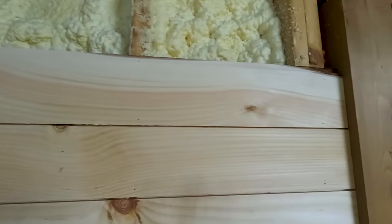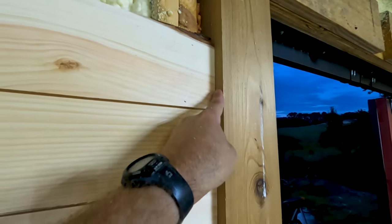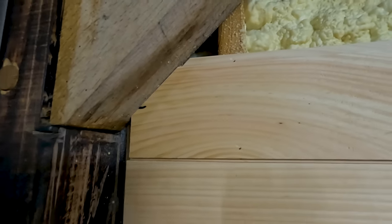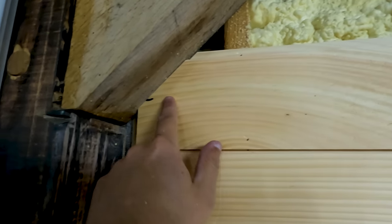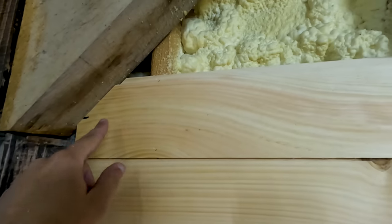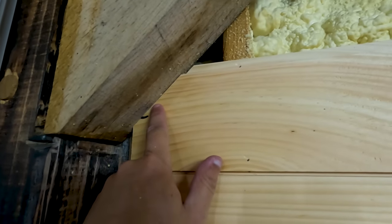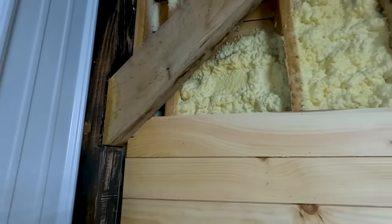Here's the board we just installed — a good tight fit right there against that Western red cedar post, even though we will come back with some trim. Over here is what I'm really proud of: I was able to get that really tight against this white oak four-by-six brace. Look how tight that is right there. I'm going to put trim on this, but in a hundred years when the Barnwood Builders Season 505 takes this barn down, they'll see these miters and know the guy that built it paid attention to what he was doing. I'm really happy with this.